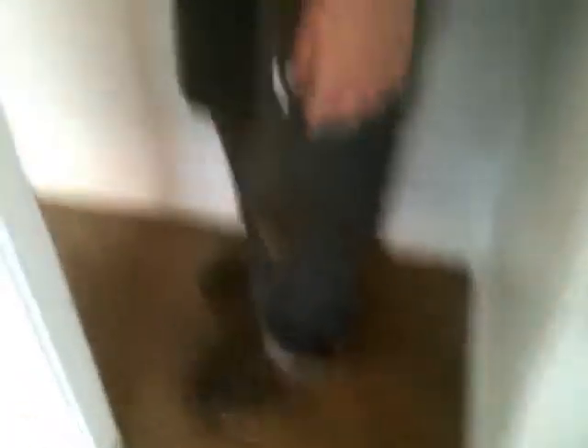What I did today was I scrubbed it using paint stripper and stripped a lot of this tar or bitumen-based adhesive — a sort of dark brown-black thick layer on the floorboards. I used a chemical stripper along with soap and water, a wire brush, and a lot of effort, and basically cleaned up this area. I took out the shelves, took down the doors of the closet, and I'm cleaning it up around the edges with a fresh coat of paint.